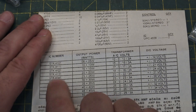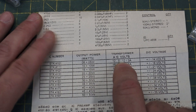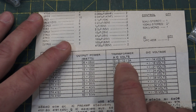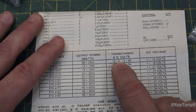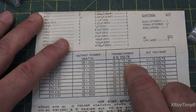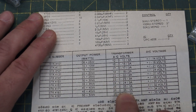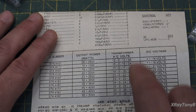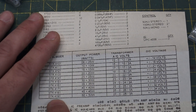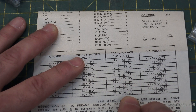Looking at the printout, it lists the chip specs. The 4101 is rated at six watts per channel and only requires a 24-volt center tapped transformer — that's 12-0-12 at three amps. The 4191, the biggest size, requires a 28-0-28 configuration, so it's going to need a 56-volt center tapped transformer. Looking at these voltages compared to the wattages, I would have to say this looks legit so far.